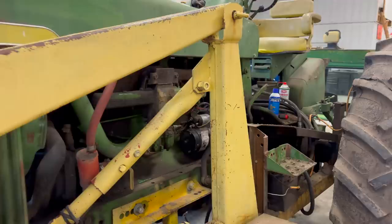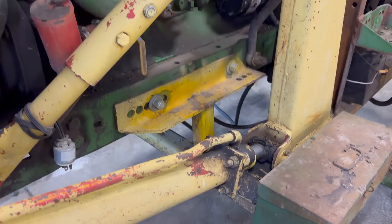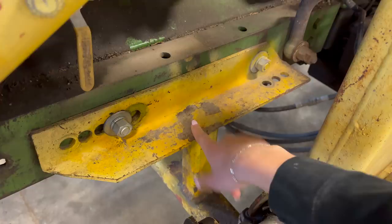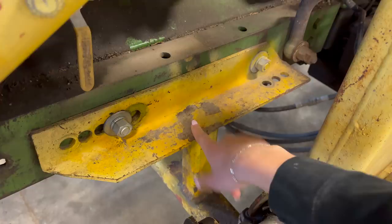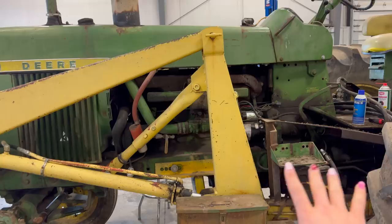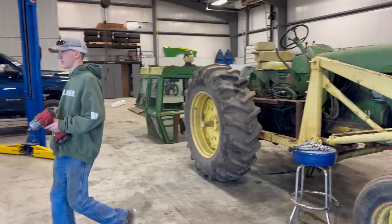The time has come, the loader is coming off. Upon further investigation, it's probably a really good thing we're taking this off because most of the bolts are loose or broken on it, so I don't think it's really safe to use anyways. This is mounted to the frame of the tractor but we can't take this off first — we need to unbolt this here, and there are another two under here, and the same on the other side. Then we're going to roll the tractor backwards, use the chain hoist to hold the loader up so we can get it out, and then once that's removed we can take the frame off.